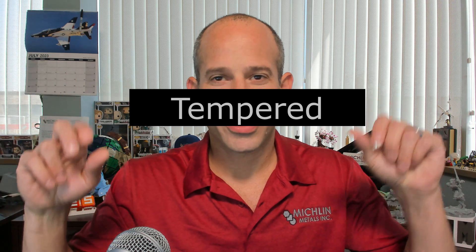To get a combination of corrosion performance and useful strength and hardness, the material is tempered to make it less brittle. So now we are balancing the hardness, strength, and corrosion performance we need. These martensitic stainless types also lose toughness in impact at low temperatures, so we need to factor that in as well. Sounds complicated and best left to the engineers and designers.